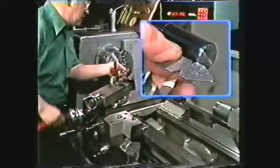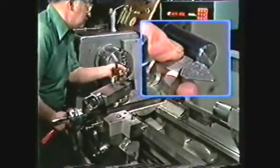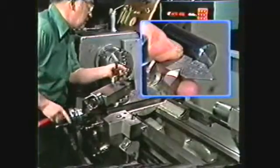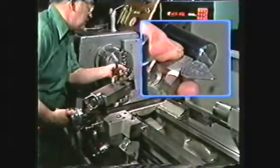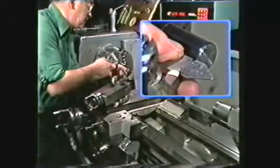The center gauge is now used as an alignment tool. Place one parallel side of the center gauge against the work so that it is in line with the axis of the work. Then move the tool so that the 60-degree included angle fits in the V notch on the other parallel side.